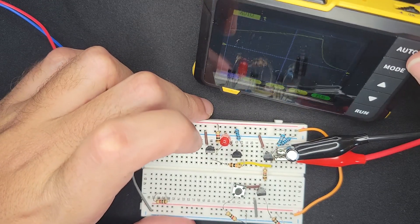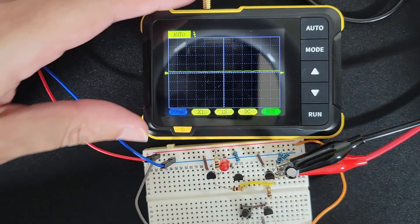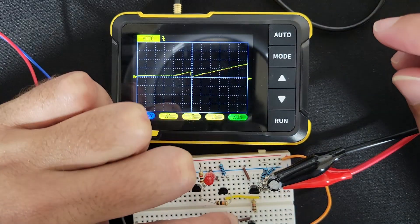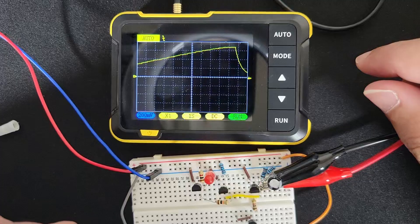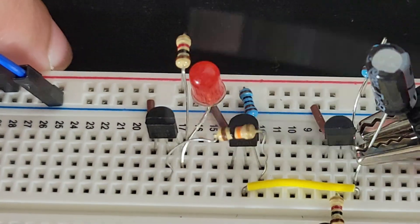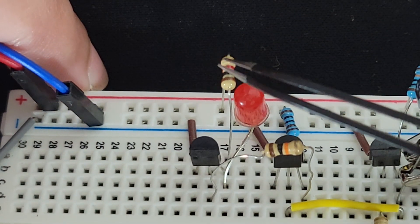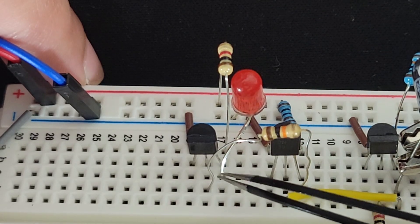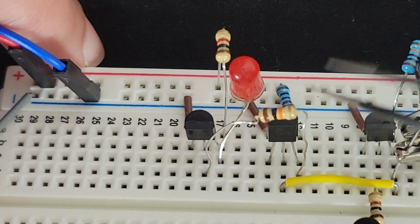The only problem is the LED does not stay on after we release the button. So how do we solve that? With the lights dimmed you can see this a lot better. We hold and we can see it charging, charging, charging — and then the LED should turn on any second — and then we release, the LED goes out, capacitor discharges. The question is how do we keep the LED on? When this resistor is on, the LED is off. What we need to do is basically have a feedback loop where the power that goes into the LED to turn it on also powers the base of this transistor, keeping this resistor off.